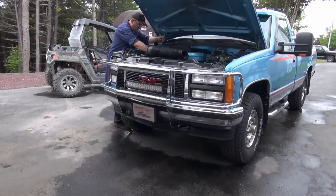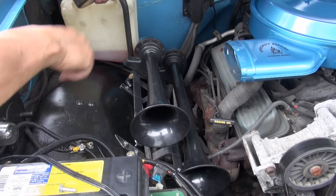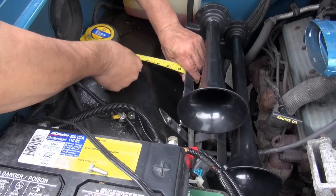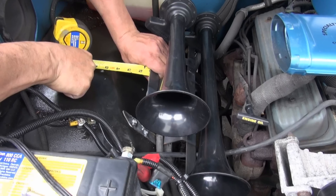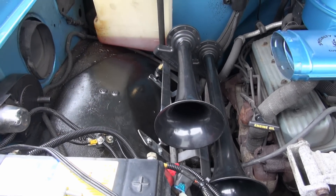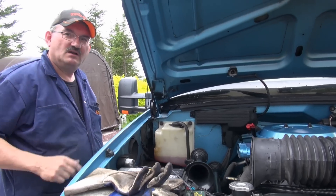You'll get a better idea what I'm doing here now. I have it bolted to the inner fender but there's still a bit of give in it because I'm only using 1/8 flat bar, 1/8 by 1 inch. I have this opportunity here - there are already two holes there, just take the plugs out. So what I'm going to do is make up another bracket that will come down and bend like that. If I had it say 7 inches long, that would do it, and that will really add support. Once that's on there and bolted down, it's going to be really tight. I can join my hoses on the bottom - they're only light horns. Then I can remove it, bead blast it, prime it, paint it, assemble and run the hoses. Take some split loom and run over the hose too - that way it all looks like it's wired.